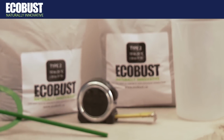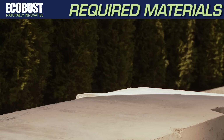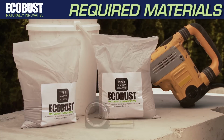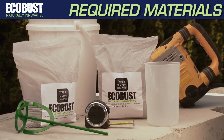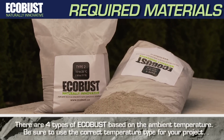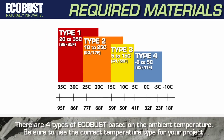Gather together the materials you'll need before you start your project. These include the correct temperature range ECOBUST product type, a drill, bucket, tape measure, measuring cup, and mixing paddle. There are 4 types of ECOBUST based on the ambient temperature. Be sure to use the correct temperature type for your project.